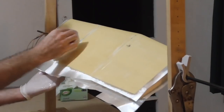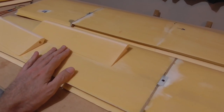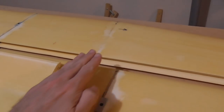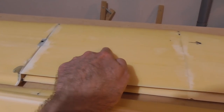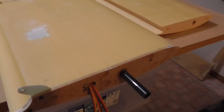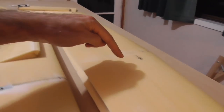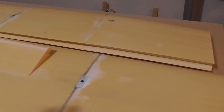That's all the wing pieces and control surface pieces glassed, cured, sanded, and tidied up. It took a while because there are quite a lot of pieces, but it turned out quite nice. For once I didn't get any brush bristles under the glass as I was laying it down - which is amazing, I don't think I've ever managed that before. The wing tips are a little bit softer than I'd hoped - the spar only goes to about mid-span and there's no spar in the tip section. I think it might still be enough, but if not, the spar hole is open on this side and I could insert a 10mm tube with an 8mm connector piece if needed. But I don't think I'll need to.